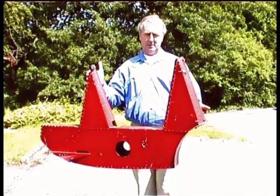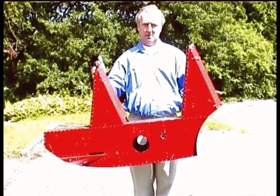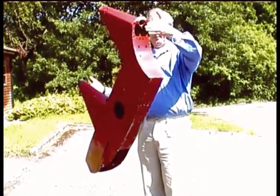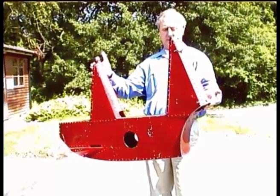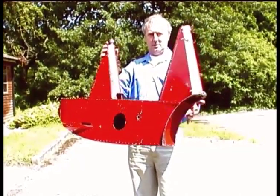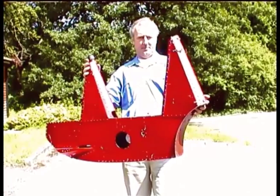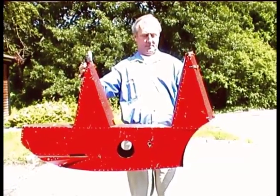Now what Keith is showing us here is the first Moulton bicycle frame. This was the monocoque, made out of 22 gauge duralumin sheet in 1959. Extremely rigid, open frame, weighing about 5.5 pounds, and you can see the riveted construction. Let's go in a little bit closer on that now, and you can see a little bit of the sort of detail there of how the thing was put together. This machine, when it was built up, had front suspension but not at the back. Went quite well, was allegedly quite noisy. Give it a tap, Keith, and we'll hear... yeah, you can imagine what that might have sounded like coming down the street. But it was the start. Very early monocoque design, arguably the first, at least of this particular type, and an interesting stage in the evolution of the Moulton.